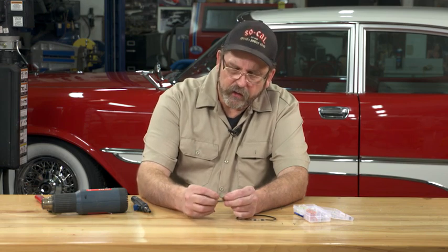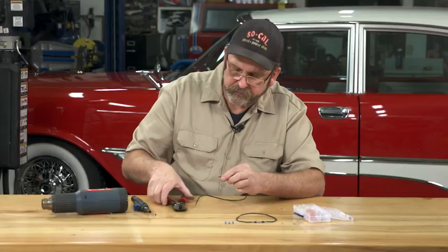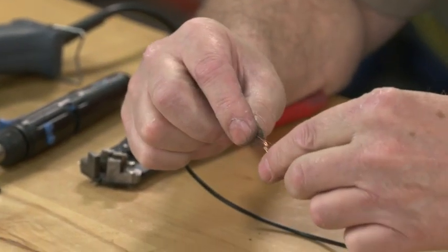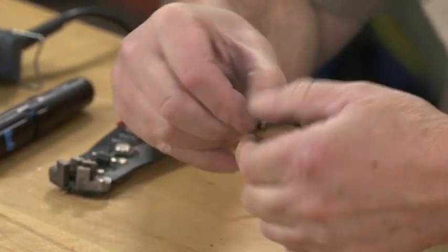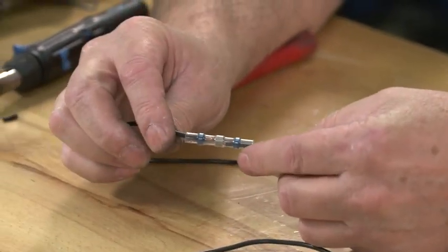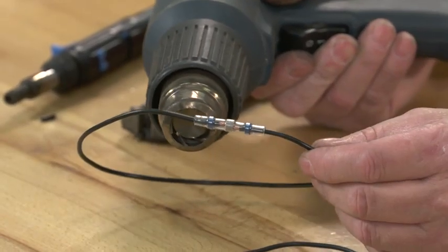Let's go through and take a first-hand look at how this is done. We've got a piece of 16-gauge wire here — we'll strip the end. If you've got the room you can slide it down and twist your wires together, or you can just push them together into the center of the solder connector. Once you've done that, slide it over the top and kind of center that solder over the wires. Now we're ready to start. I like to heat up the ends first to get it to shrink down and hold in place.